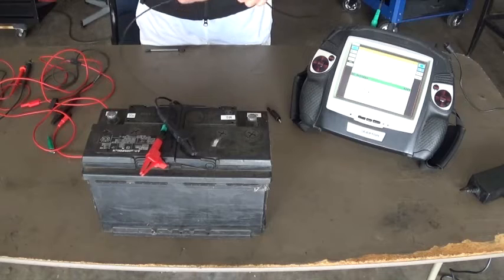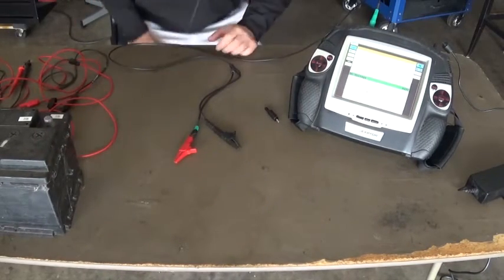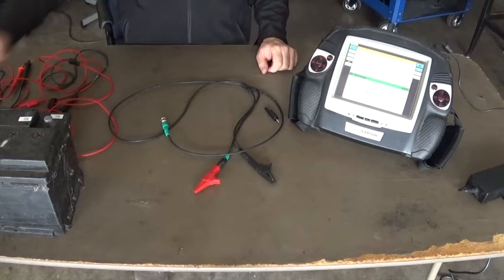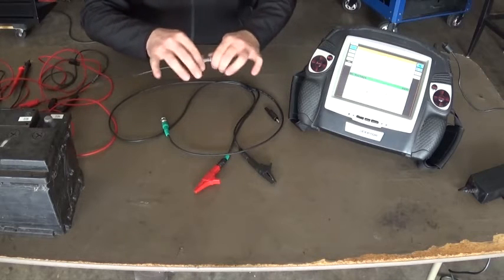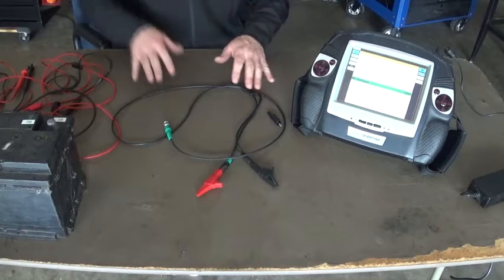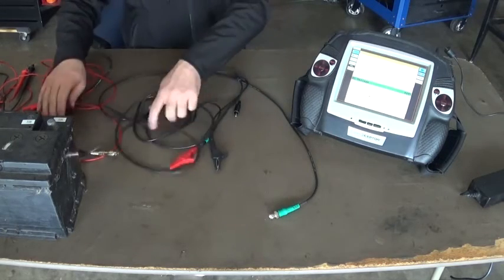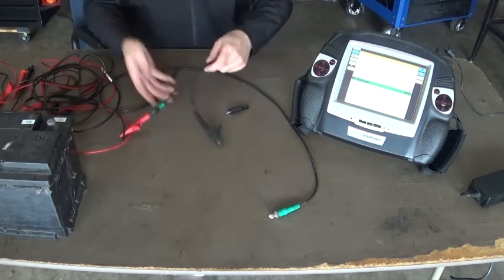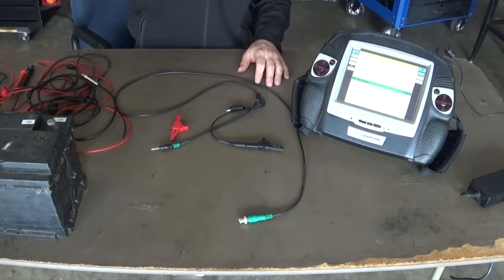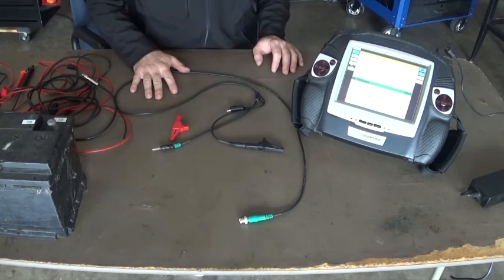That is why we have to be very careful, especially with cheaper brands. Check these leads often — make sure there is no obvious external damage, check for continuity, check for shorts, check for opens, and make sure the connectors are nice and snug on your scope. Because when you move these things and see dropouts in your signal, it is going to mess you up big time. If this happens, repair the leads if you can, or do what I did and cut the end off. Don't put them back in your drawer and do testing with them because you can mess up your readings or damage your components if you have shorted leads. Thank you so much for watching and see you next time.